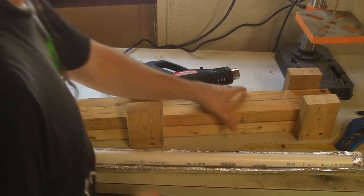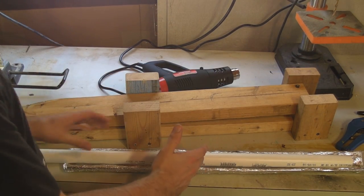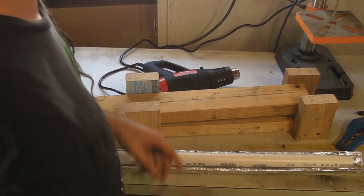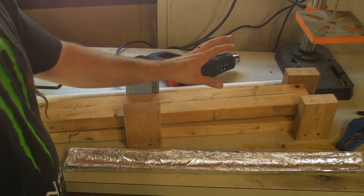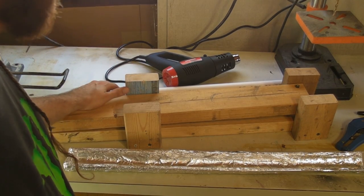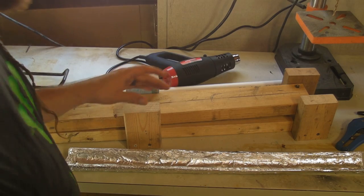Now basically this is just a little jig made out of some wood that we can, after we heat up the PVC real limp, stick it in, step on it real hard, and it's going to flatten both of the limbs to the same angle of flatness. Now, assuming you don't have a flattening jig or a heating trough, I have a video, I'll post the link in the description box, and I go over how to make each one of these and how you can customize them for your own use.